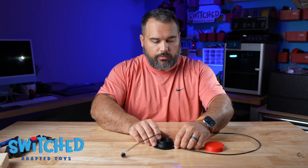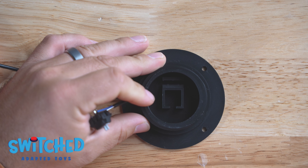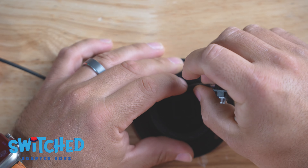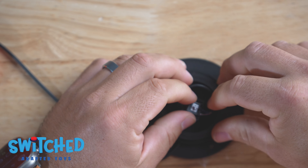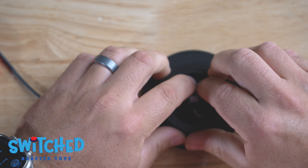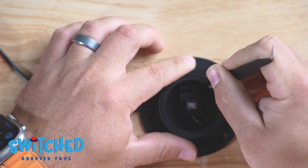Now that I know everything works, I'll take out some of the slack. Inside the base there's a printed capture slot that holds the wire in place so if someone yanks it, it doesn't pull everything out. Leave a little slack to wrap around the box, press the switch housing down so it clicks into place, then pull out extra slack and press the wire down into the capture slot — use a screwdriver to make sure it's seated nicely.